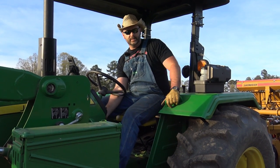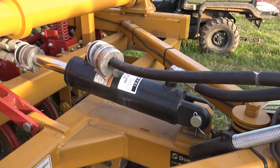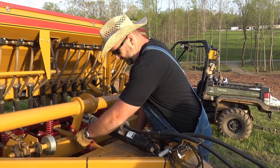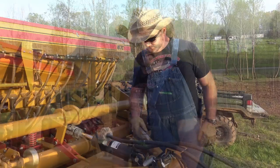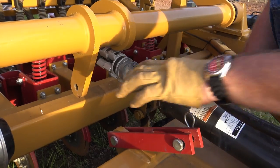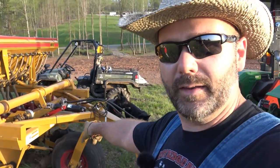Be sure your butt is always in the seat when you're starting a tractor. What you'll see now is this hydraulic cylinder going up, taking the tension off. We've got a lever on the back of the tractor that raises and lowers by controlling this cylinder. We raise it up, pull this pin out, set the little red piece aside, put our pin back in so it doesn't get lost, and then this whole cylinder lowers down to the ground. What we just did was set the drill down on the ground, setting that wheel in motion — as that tire rolls, it starts putting seed in the ground.